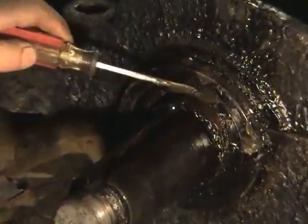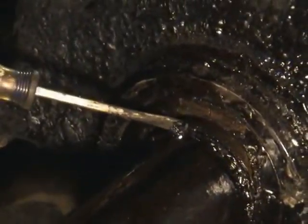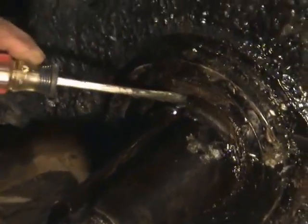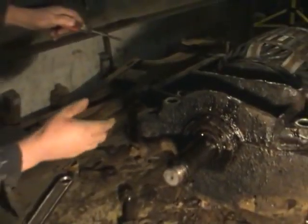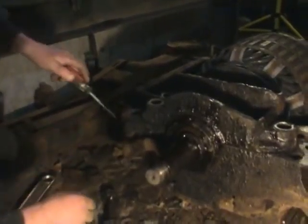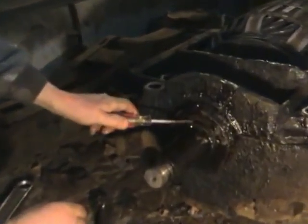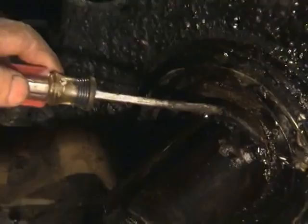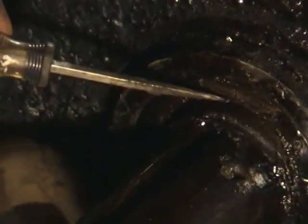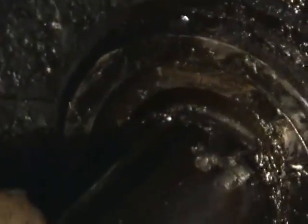See the bronze? With a material called Babbitt — Babbitt is basically a tin and lead soft material that cushions, and if there's any irregularities it will conform to them. Well, that Babbitt has worn away from its original thickness down to nothing and created this space. Now we're upside down, so that space would normally be down here, and that has got to be replaced.